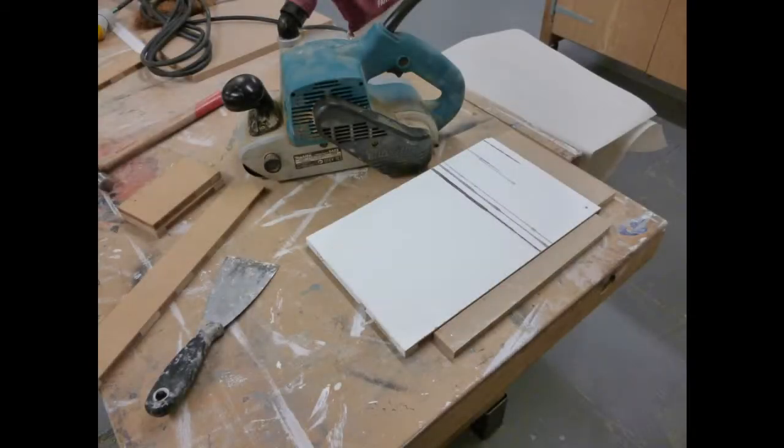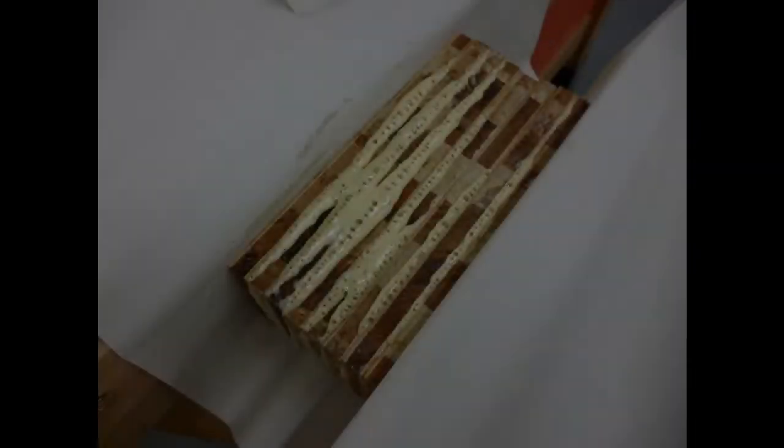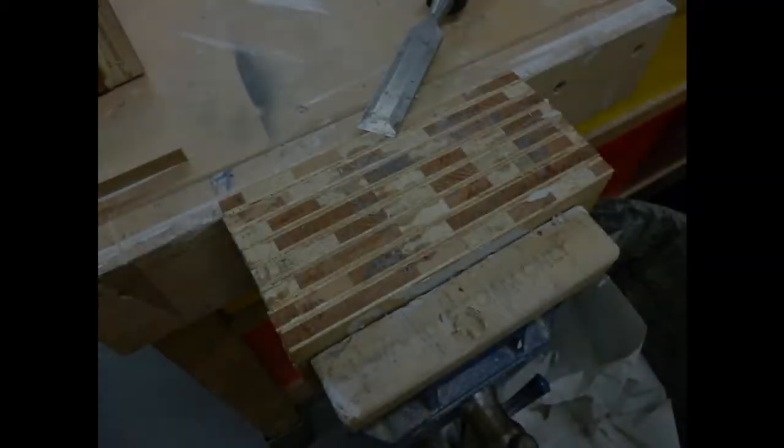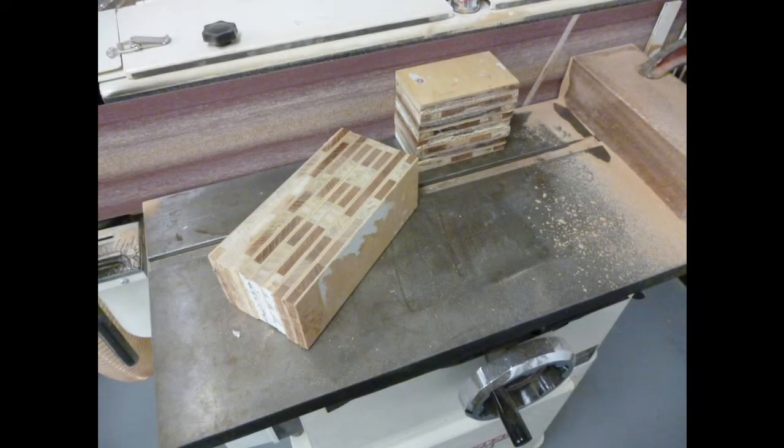To prepare the boards for bonding, first use a heat gun and scraper to remove the bulk of the paint, and then give the boards a light sanding to ensure a good bonding surface. Once this has been done, because the types of wood may be unknown, use an expanding glue to bond all of the parts together. After the glue is cured, give these a quick clean up before sanding the faces that you'll use as the datums.